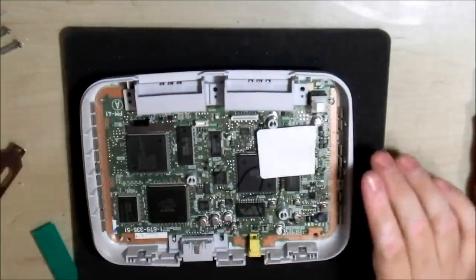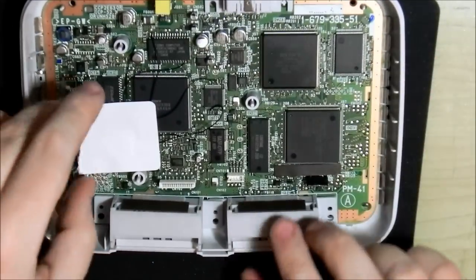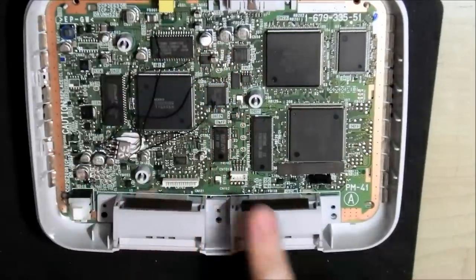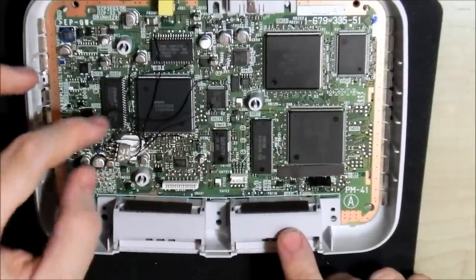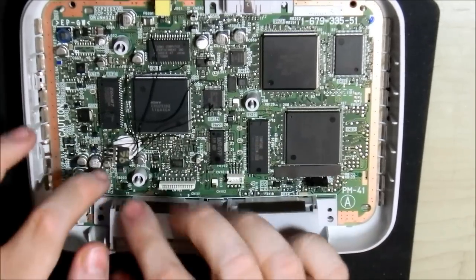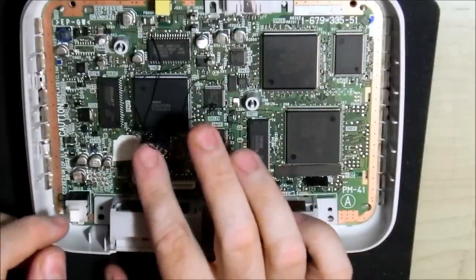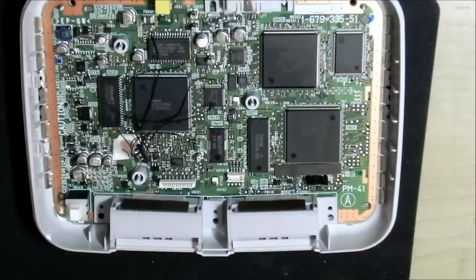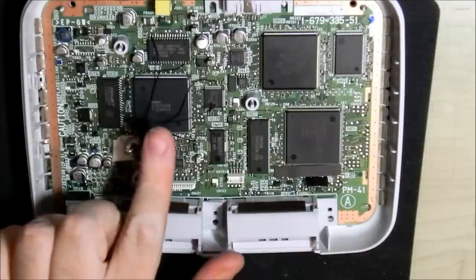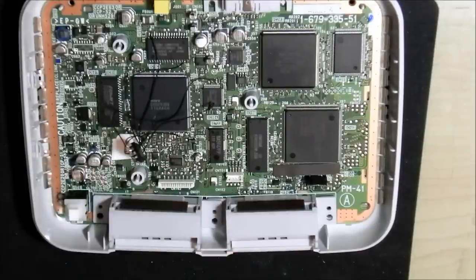Okay, there we go. Let's see what we've got here. Here's the chip — wires are quite badly soldered. The chip is just floating on a piece of paper. There's an area that's instantly a problem: there's a loose floating wire that really shouldn't be there, not connected to anything, and everything is poorly soldered together.